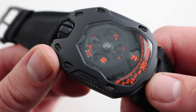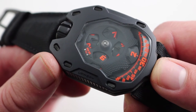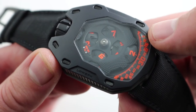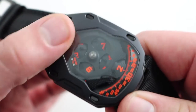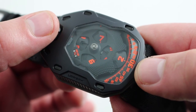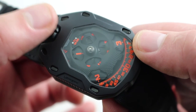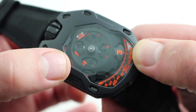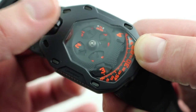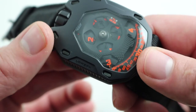A lot of what you're seeing here is, in fact, the movement of the watch. The wandering hours arrangement — pioneered in wristwatches by Audemars Piguet in the early 1990s, but really made famous by Urwerk during the 2000s — features a number of orbital disks, satellites as Urwerk calls them, sweeping past a 0 to 60 minute scale. The best way to explain how this works is to pull the crown and demonstrate — the watch is now indicating exactly 2:30. As you move the hour along the scale, the succeeding hour enters on stage right and seamlessly hands off. Watch these disks over on this corner — the disks all rotate in a series of synchronized pirouettes. It's like mechanical ballet, and that's Urwerk's essential engineering and styling ethic. This mechanism defines almost all of the company's watches.